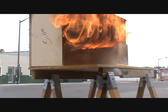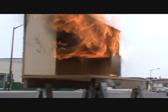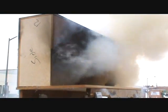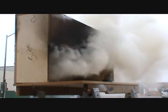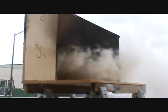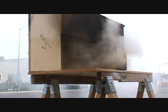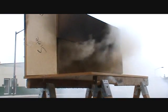With everything in active flame, we don't have hardly any smoke at all — that upper part's in full flashover. You can hit it again, knock it back down, and then we can watch it again and again. See once you hit it you get a good cloud of white smoke — you got good steam conversion and you knocked the flashover and rollover down.